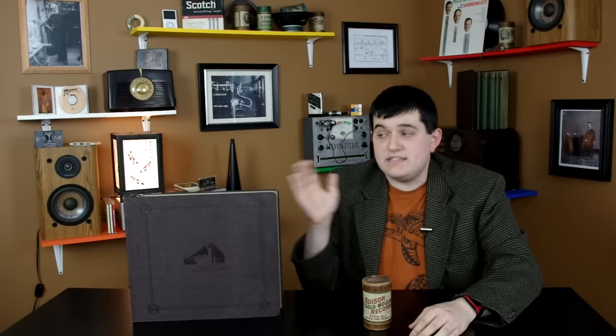Perhaps the biggest advantage of the disc was that they could be manufactured much more easily. At first, if you wanted to make another copy of a recording, you'd have to literally record it again. Duplication wasn't yet possible. But the disc had a handy way of doing it. If you record into a soft, wax disc, you can coat this disc in a metal. If you take the metal off the disc, you'll end up with an inverted master. That is, instead of the grooves being carved into its surface, the grooves would be protruding upwards, like this.